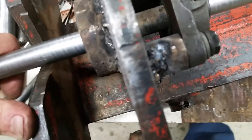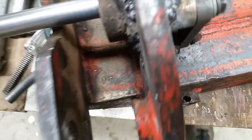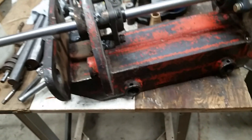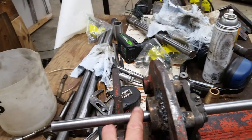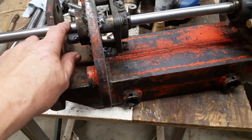So the next step — looks like I'm going to have to clean that before I can slide it out. It's a little cruddy in there from the welding, but that's okay. I can get a piece of sandpaper or emery cloth in there. So the next step is to figure out where I want to drill a hole to put a carbide bit in, and a set screw hole next to it. I think that's the next step.